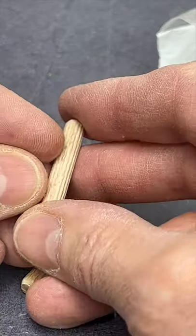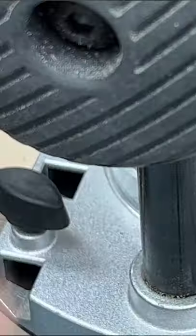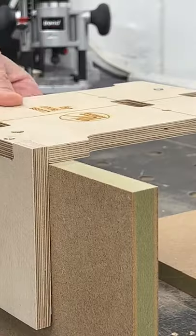For a 30mm dowel, like you'd use in an 18mm board, the plunge depth can still be set using the notch in the end of the jig. With the jig in place and clamped down, you just move your router to each end of the slot and make a static plunge to drill your hole or holes.